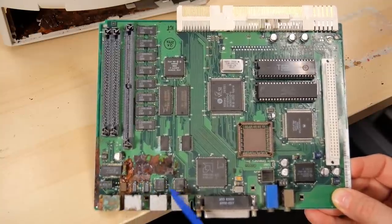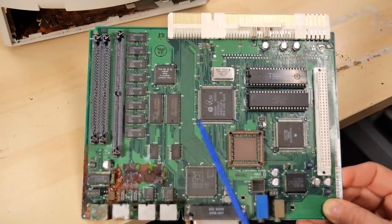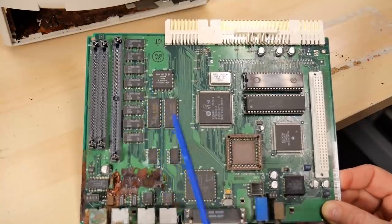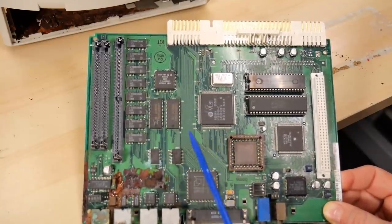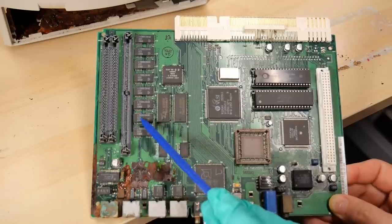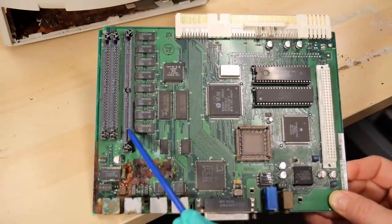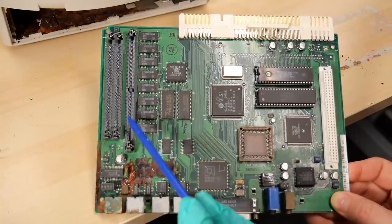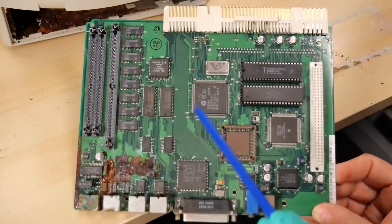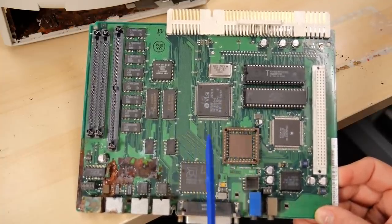It seems to be isolated to just this part of the board, which is good, because obviously if it had gotten up here into this board-to-board interconnect, that would have been it for any hope of getting this board working. It's got a 68030 running at 16 megahertz. And I can tell just by the look of this that this is a very similar motherboard in design to what is in the regular Macintosh Classic 2. I wouldn't be surprised if this board has two megabytes of RAM built in with a maximum capacity of 10 megabytes when you combine two 4-megabyte SIMMs here plus this memory. This is probably for video RAM or maybe a ROM — although this might be a ROM socket right here.